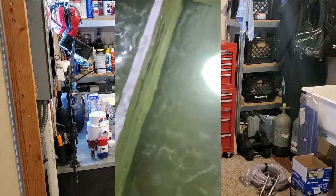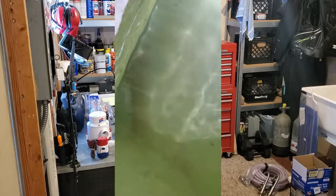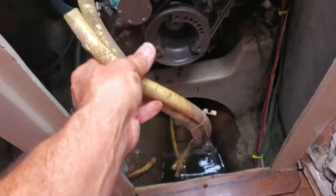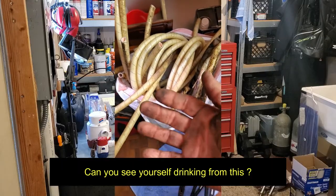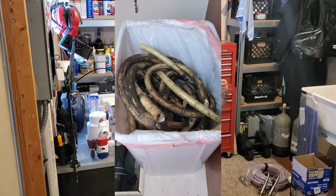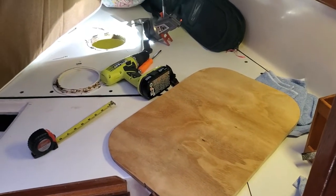Starting with the water system — the boat has an integral fiberglass tank in the v-berth. Basically the v-berth is the tank. It is compromised; it has a leak somewhere and the finish on the inside is shot, so it's basically no good. The hoses are nasty. I'm essentially removing everything — I've taken out all the hoses, emptied the tank, and I'm going to cut into the lid of the tank and insert a bladder: a 31-gallon Plastimo flexible water tank.